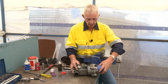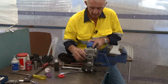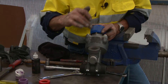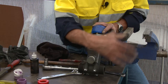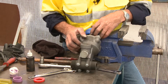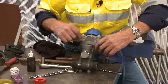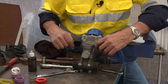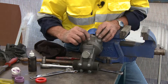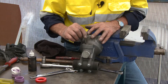What's the consequence of differentiation of pressure? Primarily, the conical section of your pot feeds grit by gravity into this valve. When you have the pusher line coming through and the grit falling into the hole, and the exhaust side is quite extensive, you'll get what we call a vortex. A vortex is where the air starts a swirling motion as it comes through, and that swirling motion inside this valve carries grit with it. Within that rotational motion, it becomes abrasive within the body of the valve itself, which can have a detrimental effect on the integrity of the housing, the piston, the piston sleeve, and so forth.